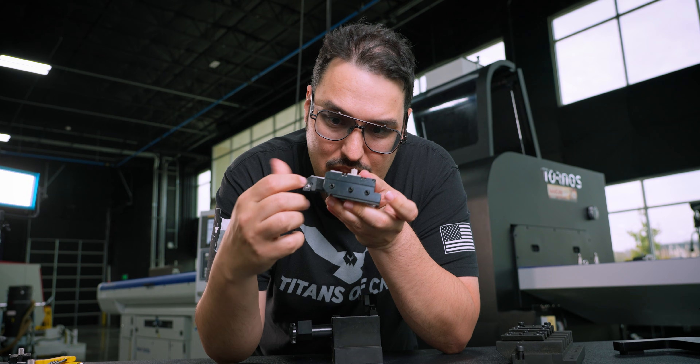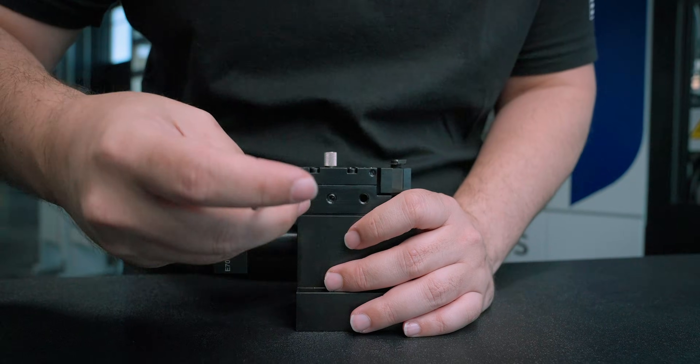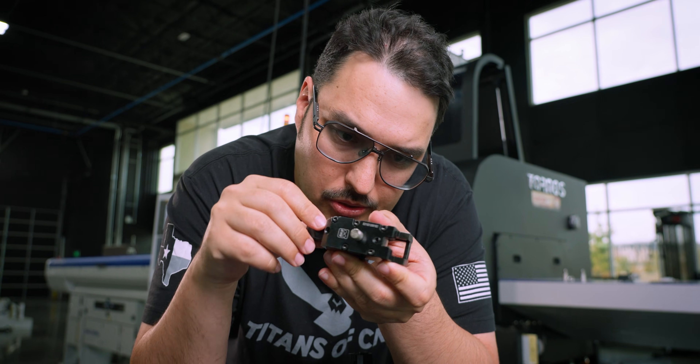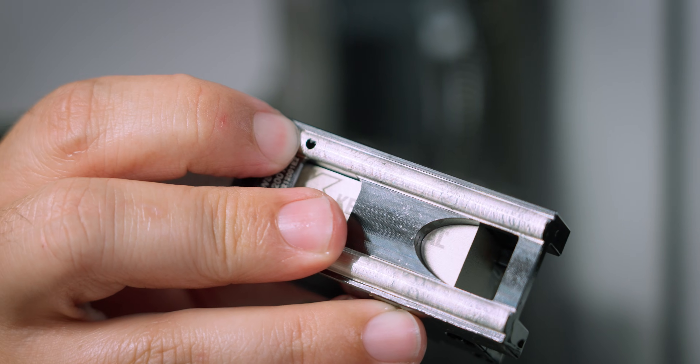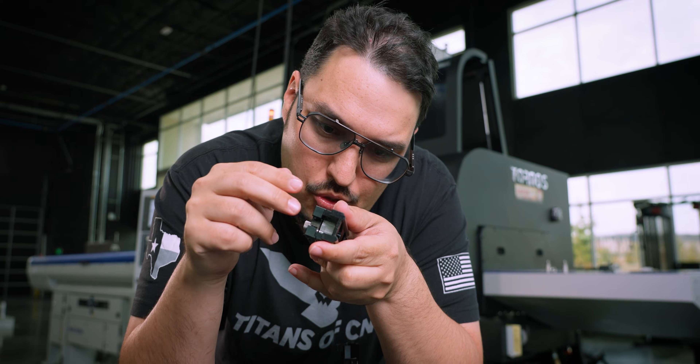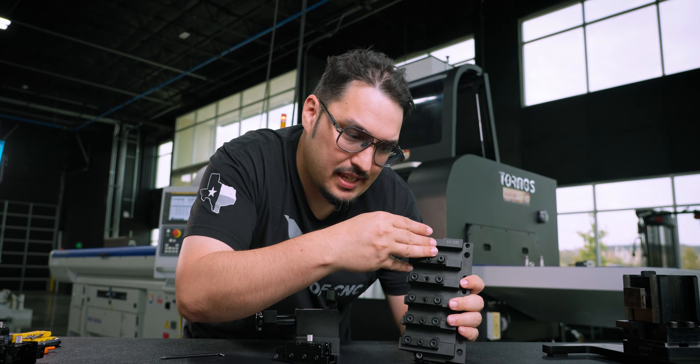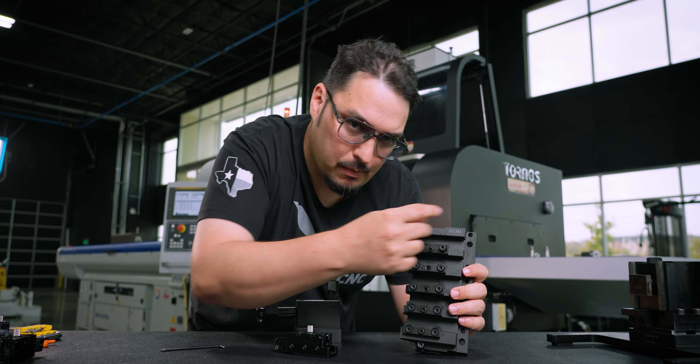This tool has its own set of set screws on the side and on the front of the tool. The only thing you might have to do is cut the back of the tool just to make it a little bit shorter, because every single time you get stick tooling from manufacturers, they're usually a little bit too long. You might have to do that anyway with the standard tools because you don't want them sticking out too far on either side of the block.